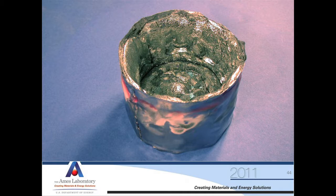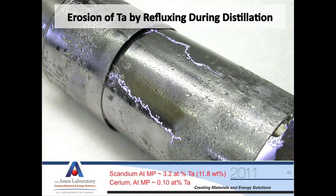This is a picture of lutetium that was distilled. The erbium is not as lumpy as this is, and that's due to the high temperatures we're at. The distillation is very difficult because of refluxing — that's where some of the metal collects in the distillation can, but it remelts and runs down the side of the crucible. We lit the inside of this can: it was 30 mils thick and we ate right through it. Because that distilled material that was refluxing didn't have any tantalum in it, it can absorb quite a bit of tantalum — it absorbed it as it ran right down the crucible. And then as soon as you have holes in the side of your crucible, your metal goes everywhere inside your containment.